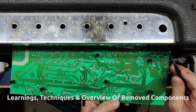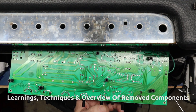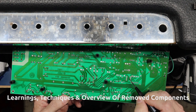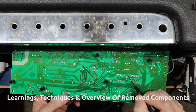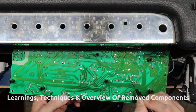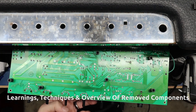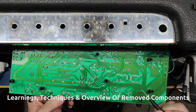Moving over, the two coupling caps are here and here. The 47 UF cathode bypass cap that we're changing to 1 UF is right here — those have been removed. For the reverb stage, I've removed the op-amp. If you very gently, just on one side of the lead, use solder wick — taking great care with dwell time and heat — you can flow the solder right off those legs. I press against the leg to confirm it's free, and this op-amp just dropped right out. Not as intimidating as it might seem.